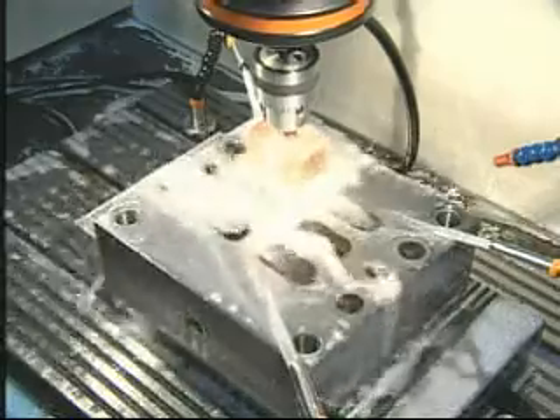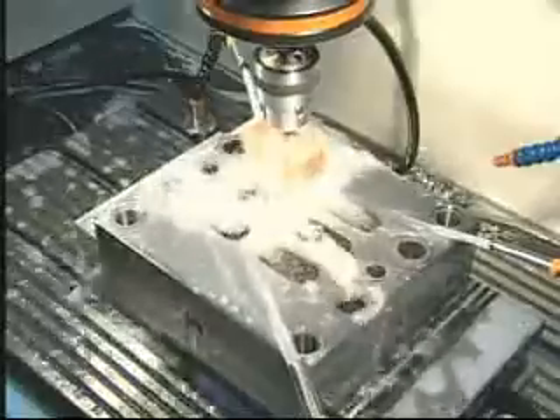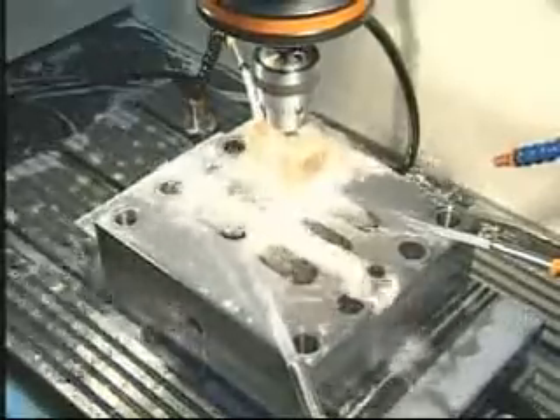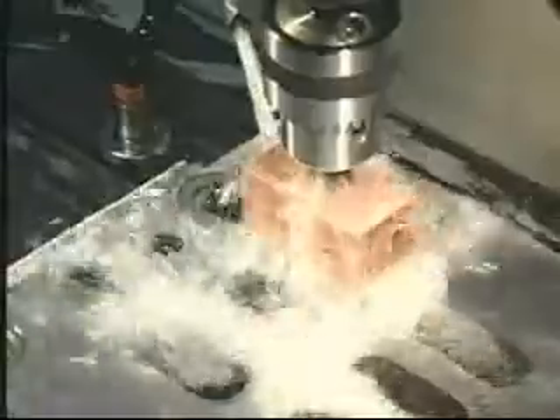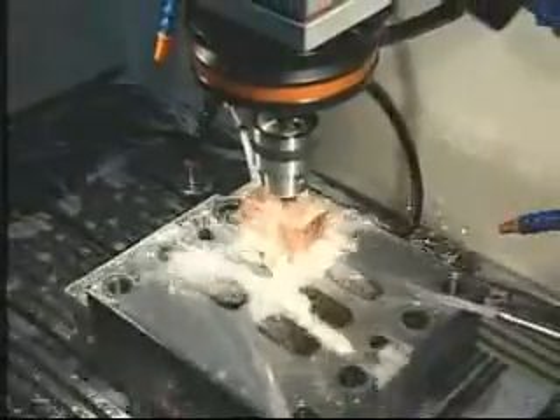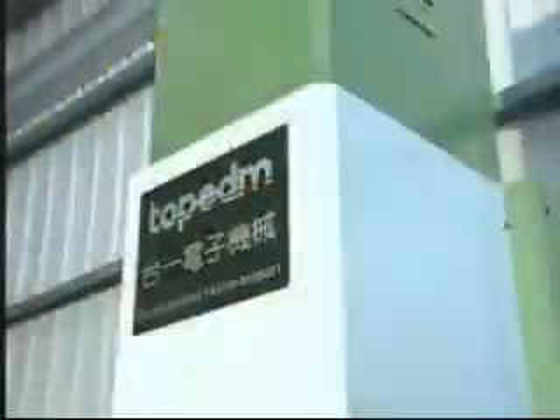The orbiting mode includes circular, rectangle and taper enlargement. A maximum of 99 stages machining conditions can be set, including spark time, jumping, voltage polarity, material selection, etc. To meet different kinds of demands, it finishes the job from rough to fine machining.